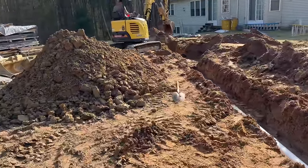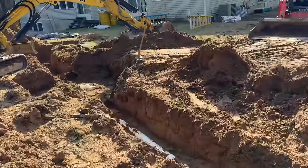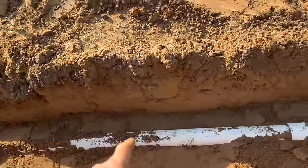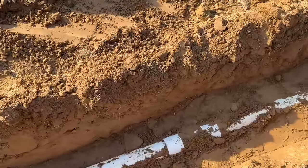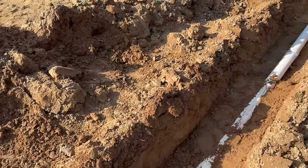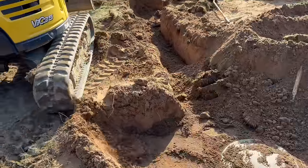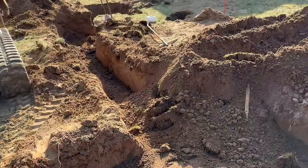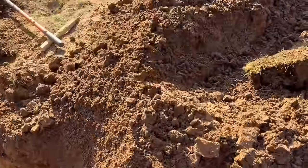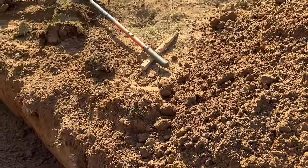And we're gonna put some water in that tank. It's a plastic tank. Greg's just filling it up with sand. We already bed this section. That's what you do. You bed it in by hand, put a little bit over to the top, and then stomp it in with your feet, and then backfill it. There's no rocks in this soil either, so if you got stones in your soil, you want to make sure you don't use that soil. This is all sand. This is nice sand. It's just dry sand. They must have hauled it in here. This lot's all clay.